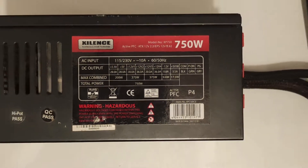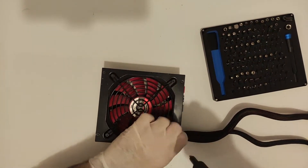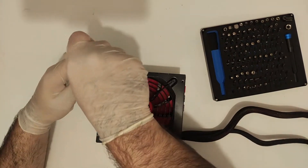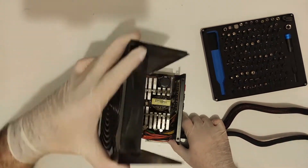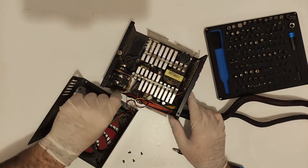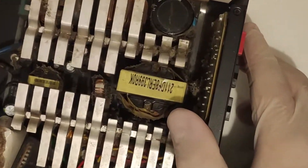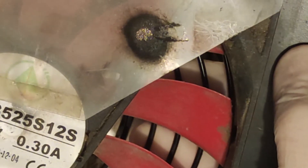And now an example of what a bad PSU looks like inside. The 750W unit is very heavy and it was considered a good high-end PSU at a decent price tag when it was new. Someone tripped over the power cord and created a short that led to premature capacitor failure — not really an uncommon thing. Opening it up, the most obvious thing to notice is a burn mark on the plastic and a faint burnt smell. And if something like this greets you, the best course of action is to stop there.